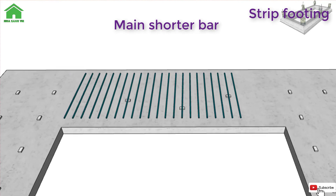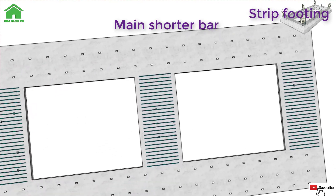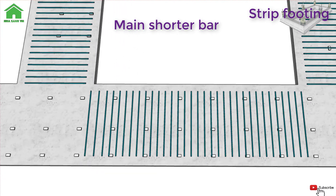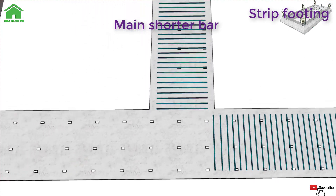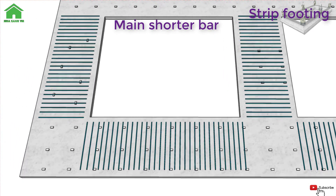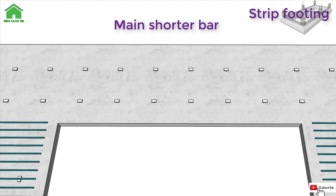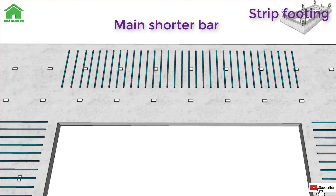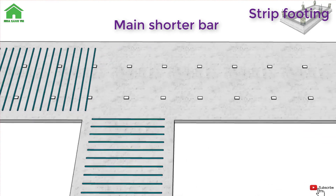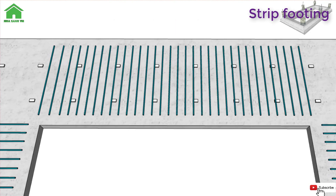As the name suggests, the formation is in a strip of linear structure that's ultimately designed to spread the load across the total area of the soil. It is an option suited to most soil types as long as they boast a suitable bearing capacity. Strip footing can therefore provide continuous support, which is most commonly level but can also be stepped to support linear structures such as load-bearing walls.